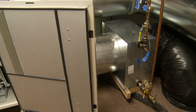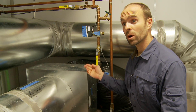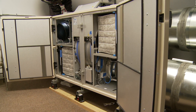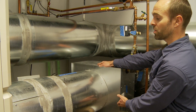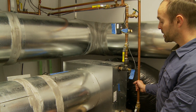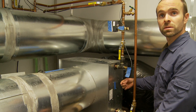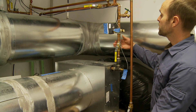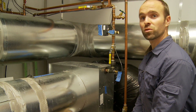One of the complaints sometimes heard with heat recovery ventilators is that if you're sitting there working, it may be pulling in cool air and blowing it on you. Even though it may be 20 below outside and you are recovering heat, the supply air is only going to be so warm, and that can be uncomfortable. One way to overcome that is to put a reheater to heat up the supply air. In this case it's a hydronic reheater — hot glycol goes through a liquid-to-air heat exchanger. As the air blows across it, it extracts heat from the glycol, which then gets reheated by the heating system. As a result, you get comfortable air blowing on you.